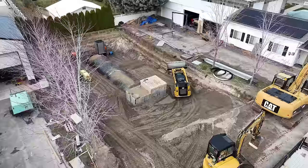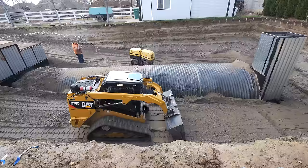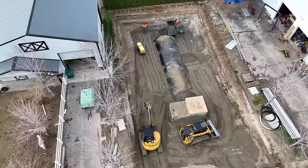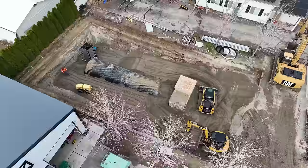I wouldn't have imagined before this project that filling the hole actually takes longer than digging it, because each scoop of dirt has to be placed down and then compacted in levels to make sure everything stays solid and the ground doesn't sink once the grass is back on top. We have hoses running non-stop to help compact the soil, keeping loose dust stuck between the larger rocks. All the compacting helps the bunker tube maintain its shape as the earth around it supports the entire structure — which is what allows this tube to be buried up to 100 feet underground, even though we're only going 6 feet.